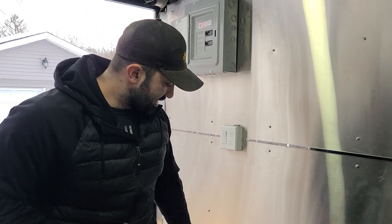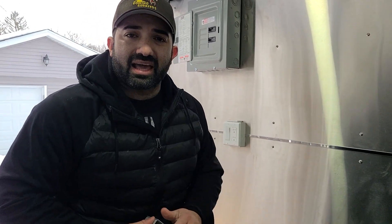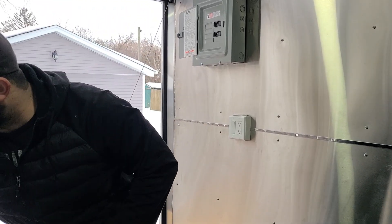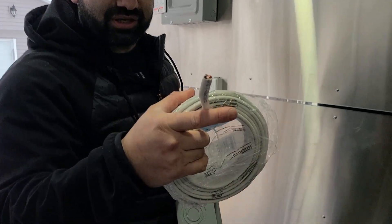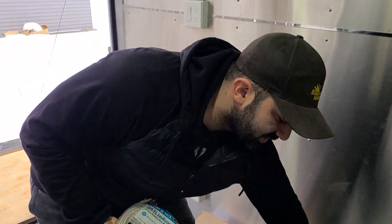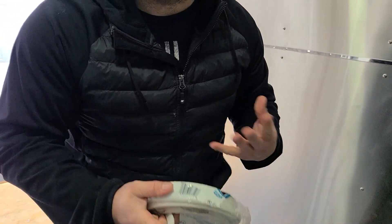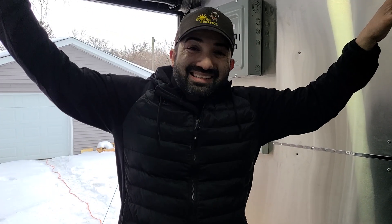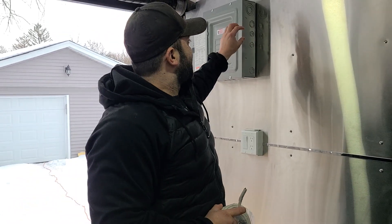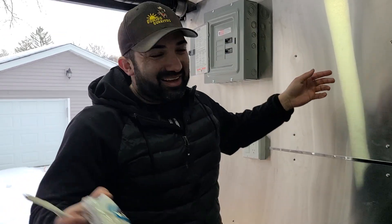All that means is that the cable that I use — called the service cable — is bigger. You can have a 14-gauge cable like this; this is a 14-3. A 14-3 cable is what you use in your branches — we call them branches — because from here you get your circuits out. What comes out of here is called a home run, kind of like in baseball: it's the main thing.